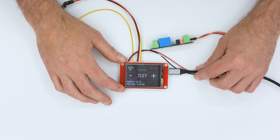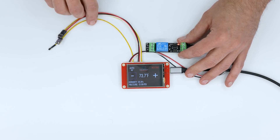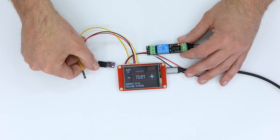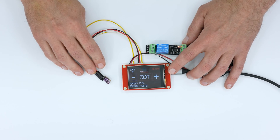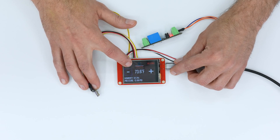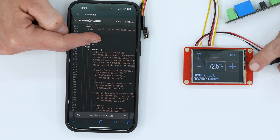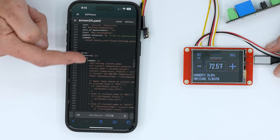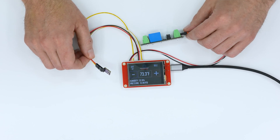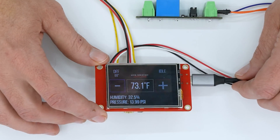In all seriousness, I went into this project with the goal of creating a thermostat to control my gas garage heaters. I was already planning to make an ESP32-powered thermostat before Elecrow emailed me, but now I have one with a screen on it. My main goal was to have the thermostat work on its own without any Home Assistant requirements, but still have fluid interaction with Home Assistant and any automations I wanted to deploy. That meant using ESPHome and configuring everything in YAML. I set up global variables to store data like temperature values or the current mode, tied it into a BME280 sensor — an I2C module that gives me temperature, humidity, and air pressure. To actually control the thermostat, since it's a simple two-wire system, all I needed was a relay. I created three basic modes: on, off, and auto, set up a desired temperature value and controls to raise or lower it. And before you know it, 30 hours later, I have myself a thermostat.